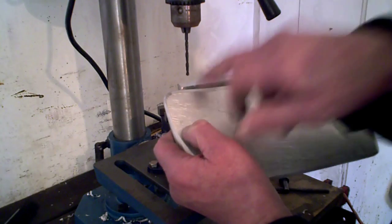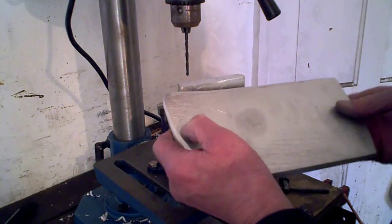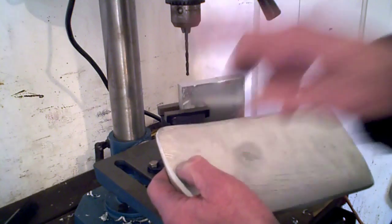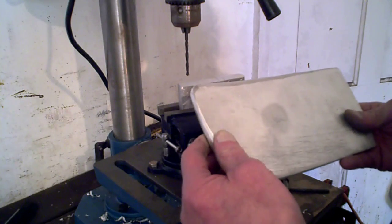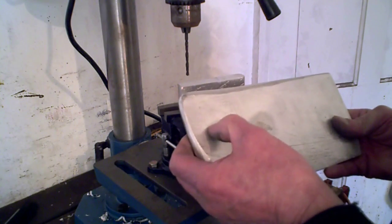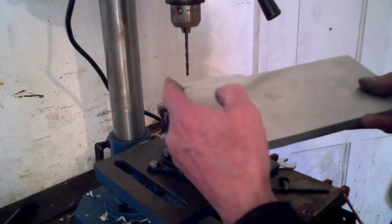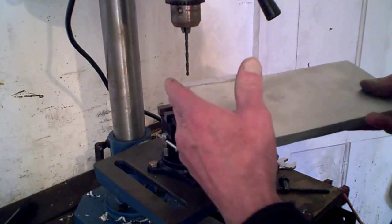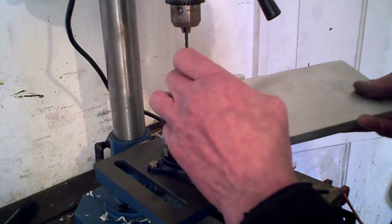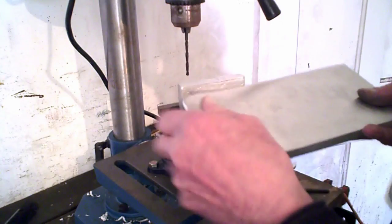So I'll tell you the best way of doing it, and I'll show you the last hole when I've finished this. Right, so you drill one hole in there and tap it, and then you can drill the corresponding clearance hole in here, because it doesn't need to be exact. You can get it pretty close, but for the tapped holes to line up they have to be exact.